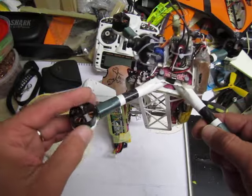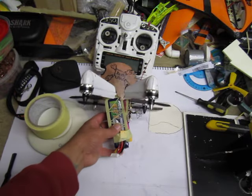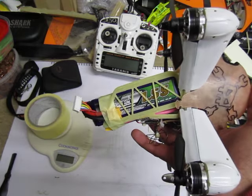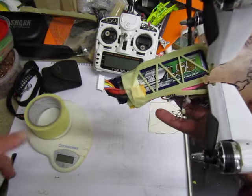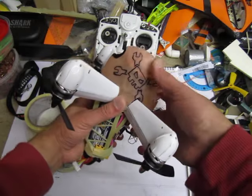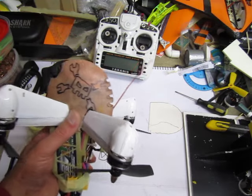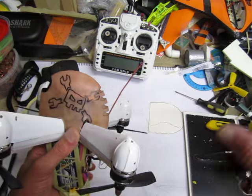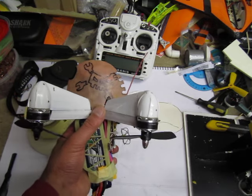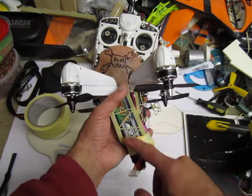I was trying the high voltage batteries — 4-cell high voltage battery — and it was all grand. But then when I went to 6-cell, there are 1.55 6-cell batteries used for the 450-size helis. I believe that's the best weight, capacity, and C-rating ratio in a battery. When I stuck on that battery, by the amps that this one draws, it became bloody heavy. I lifted it up in the air, one pass, and I could feel that on a second pass it was going a little bit slower. So this build is basically designed around the battery.